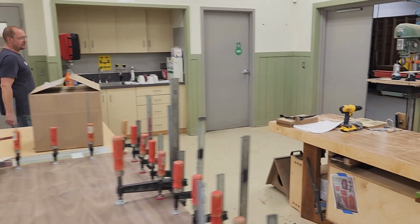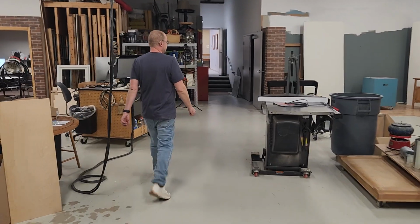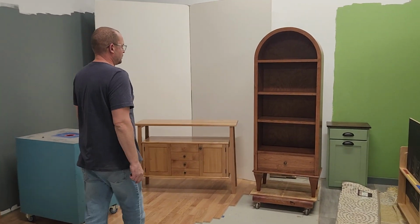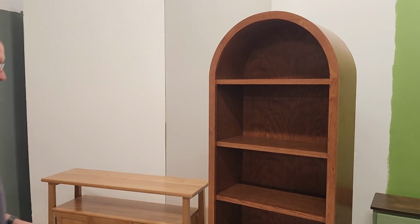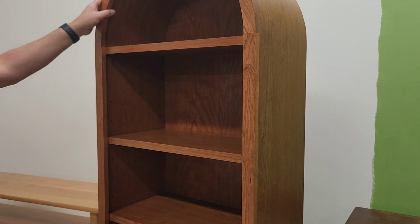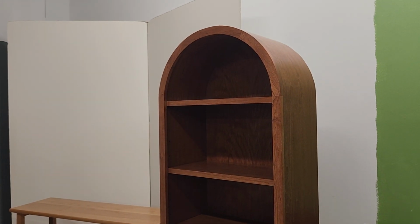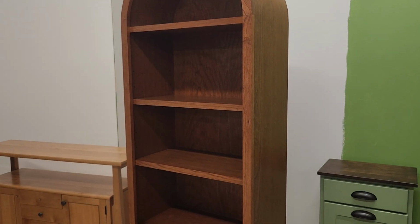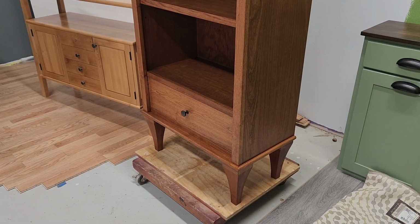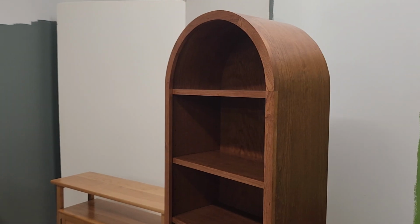Okay, follow me. Let's go and see the archstock bookcase that I got wrapped up earlier in the week. If you've been watching the last several weeks on a Thursday, I've been showing you the process of what's involved with this archstock bookcase. Made out of cherry, plywood sides, and we used 2 3/8 pieces of bendy plywood to form the top. I had a form that I made out of MDF to clamp the 2 pieces that were glued, laminated together to make that shape. And then once the main structure was all done and glued together, the fun part was the 12-foot long piece of cherry veneer that took 4 of us to tackle.